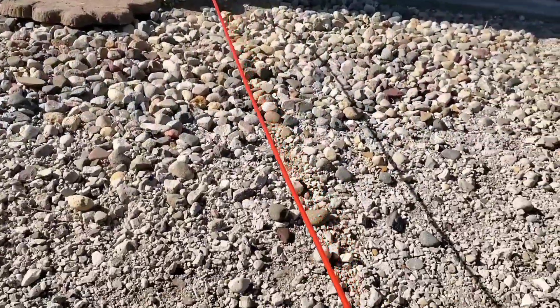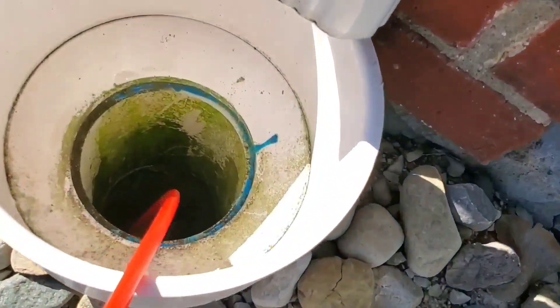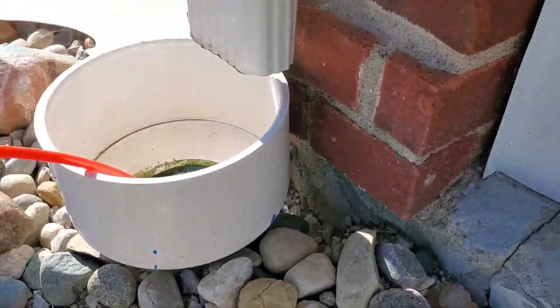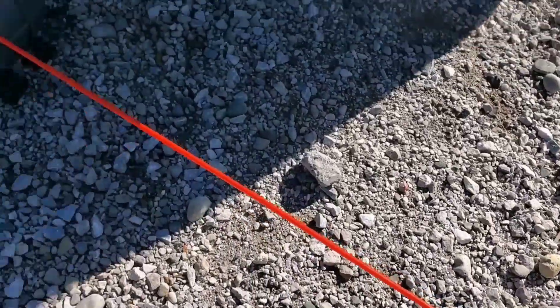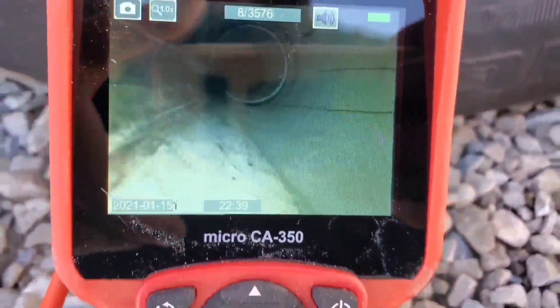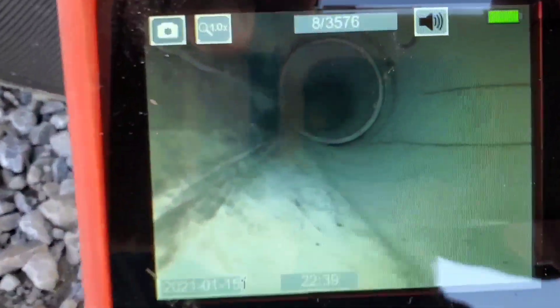That was a bell — a connection point. I'm running a camera for you guys and showing you what I already know, because I've been inside thousands of these PVC downspouts. I'm running the camera in the shade here so you can see exactly what's going on. Even though it's still flowing water, you can see this pipe is fractured in many areas.